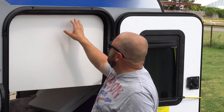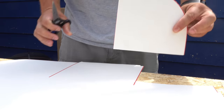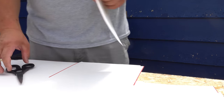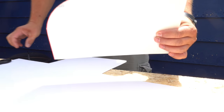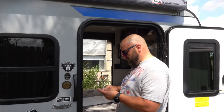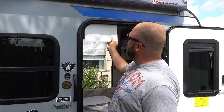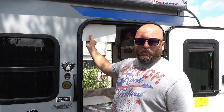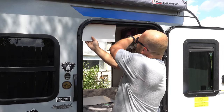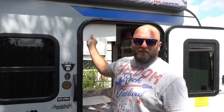Make both marks and cut it out. There's one side, there's the other. I'm going to tape these up at both corners, then take the extra piece of poster board and tape it in between the gap to make one solid piece — that way I've got the top half of the door and I can transfer it over to the plywood.